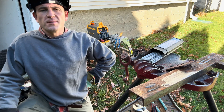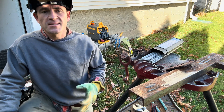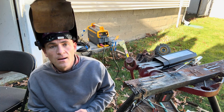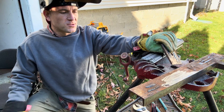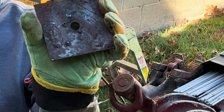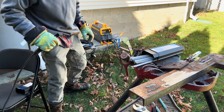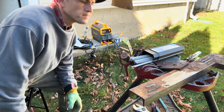I'm going to run a couple of rods — 6010 and 7018, both at 100 amps — just to show you the machine actually works. There's plenty of good rods for these machines. I'd recommend a 6011 or 7018 to my viewers. I've got two pieces of steel, both about an eighth inch and 3/16. One I cleaned up, one I left wicked rusty to show it powers through rust. We're at 100 amps on 220 volts.